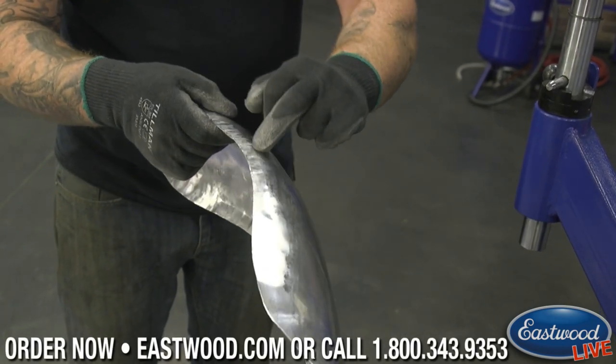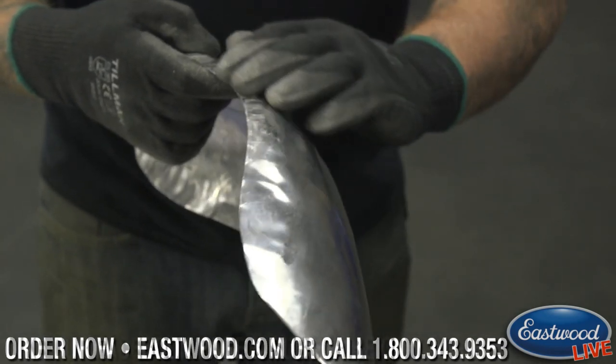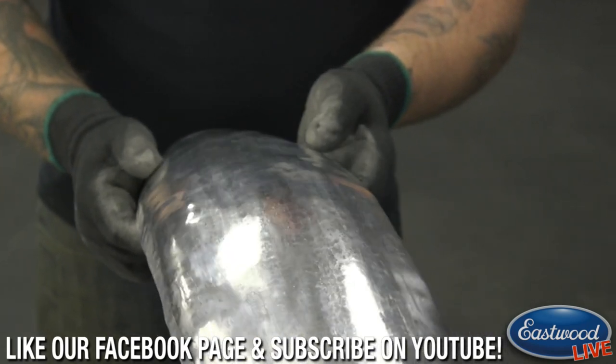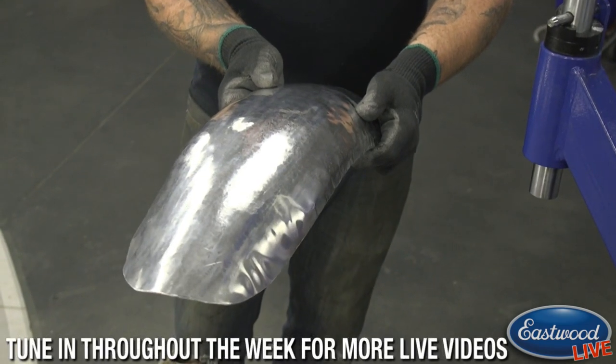And you want to stay away from that shrink area there, because if we start hitting on that, you may stretch the metal again if you sit there too long, which will make the panel open up and take the shape away. So we're just trying to smooth it out. You can see this front section here is coming along pretty good.